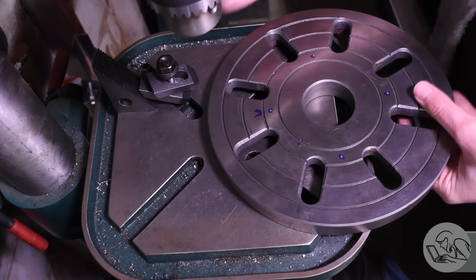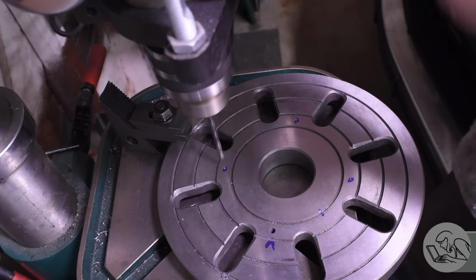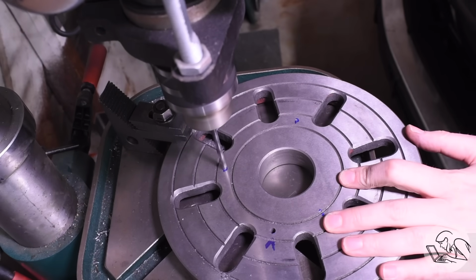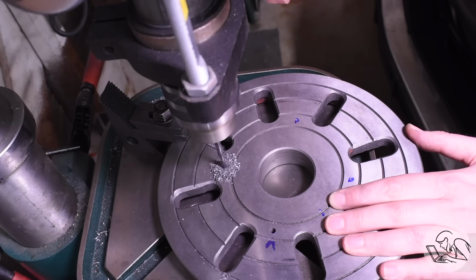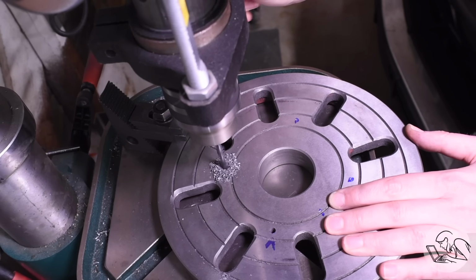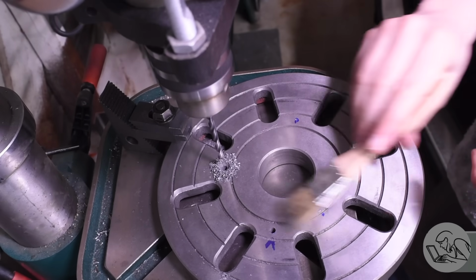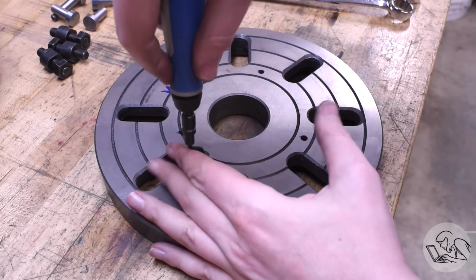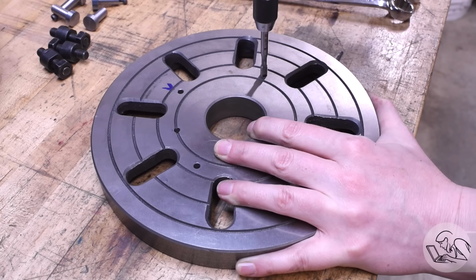One of the best pieces of advice I got for the faceplate was actually from a viewer who advised me to stop treating my faceplate like some sort of sacred artifact and just drill and tap holes wherever you need to for mounting things on it. I was struggling a lot to use those clunky factory slots there for mounting smaller parts, and that was good advice. Once you get over the fear of putting holes in your tooling, it really does speed things up and makes things a lot easier. It's a faceplate, just modify it, that's what they're for.